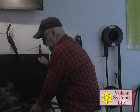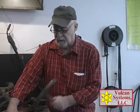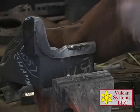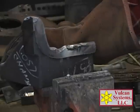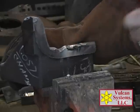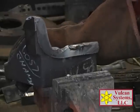We're going to get off of it right away. What we're going to do is peen this and stress relieve it while it's cooling down. The reason I'm peening this is to stress relieve it — it's getting smaller and I'm helping it stay down into the weld.